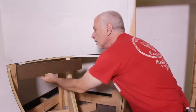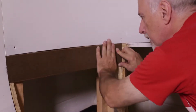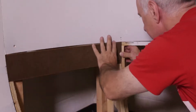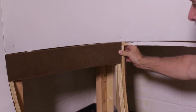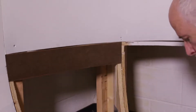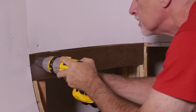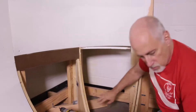Now we're going to install this first piece. We line the edge up, fold it in, and make sure we're close to our edge. I want to slide this piece back and forth until I get the curves matching as smoothly as possible. You'll notice we do have a crescent-shaped opening — that's unavoidable. Once we have it in place we screw it in. That's a pretty even match along here, and we're centered on our crescent. Now we're ready to measure our next piece.